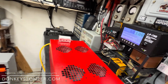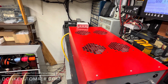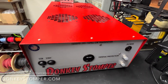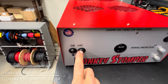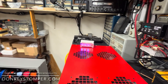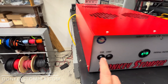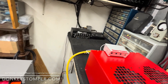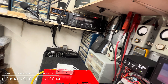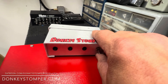You get your sideband switch and power switch — this is your main disconnect, you turn it off and everything's off. There's one little power supply that controls it; it kicks on a 100 amp relay, turns on your 220. You can turn it on here, but that's gonna light up when it does. If it's upstairs you can turn it off and leave it off. You have to switch the sideband manually right here. You can let that little power supply run as long as you want — they're not that expensive, if it goes out you can just put a new one in.